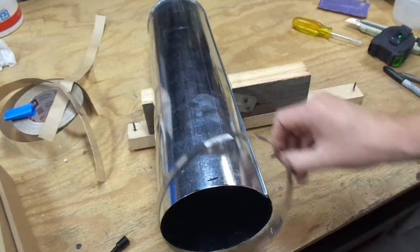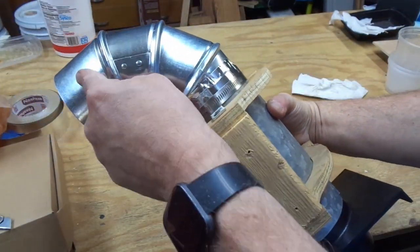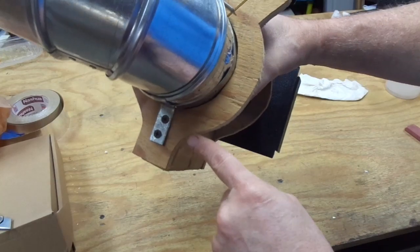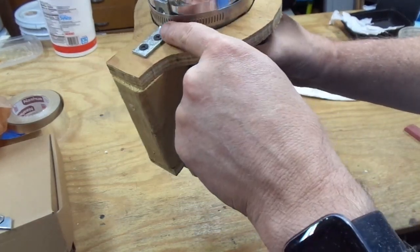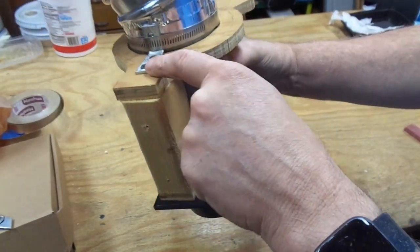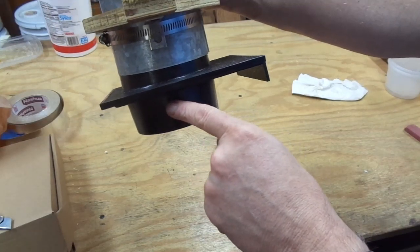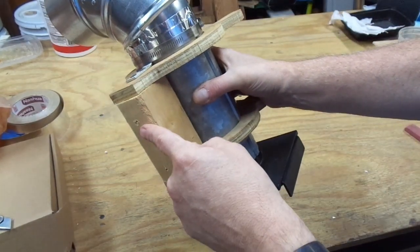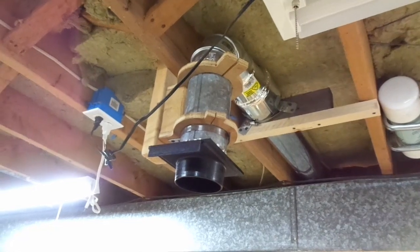Here's another quick view of how I'm supporting and bracketing this. This piece is going to come down out of the ceiling and this blast gate is going to sit out over my table saw. I created two ring brackets attached to a 2x3, with a little bracket that lets me clamp the bracket to the four inch pipe using a hose clamp. The brackets are of course attached to the wood. This piece is going to be over my table saw — here's the blast gate — and I want this to be really well supported, so this piece will attach to the ceiling above.